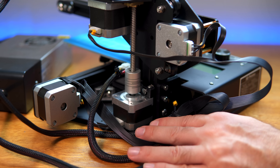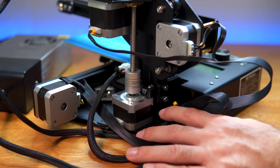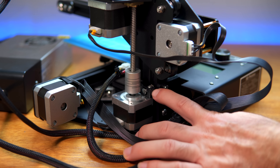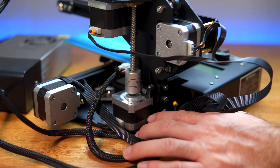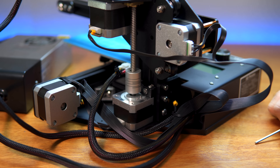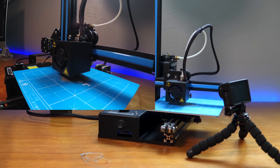I'm not the first one to have this problem. The great 3D printing community has figured this out and made a little shim that replaces this bracket — a shim behind it that addresses both axes we need. I'm going to tighten this back up and start the print of the part. I've loaded some gray PLA and made sure the bed was level, so all we have to do is start the print.